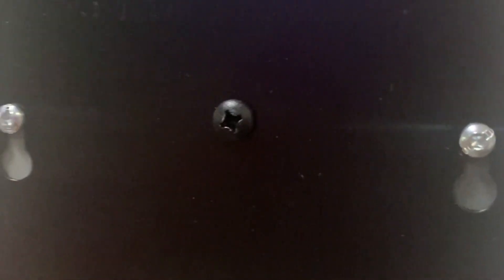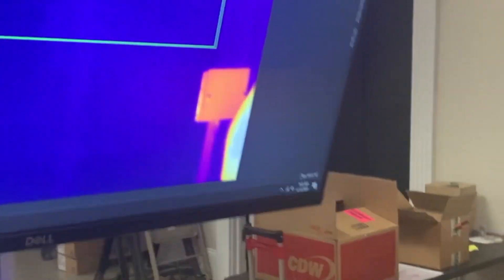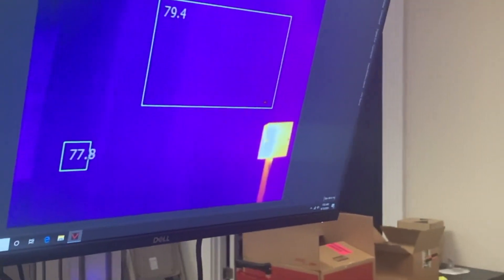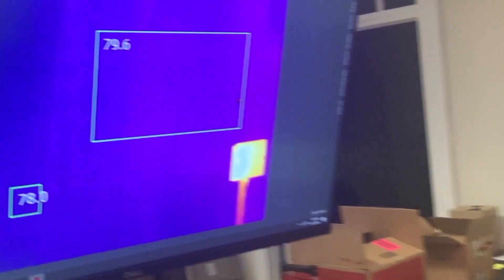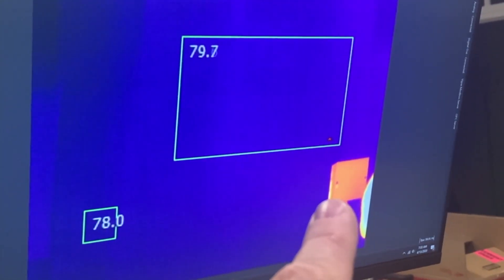For the reference emitter, this is the reference emitter cord that comes out from the bottom. It's just a quick connector, and then you have this plug that goes straight in here — a nice and easy connection. You shouldn't have to open this at all. All this is physically doing is warming up that box to give you a known reference, so that when you look in your field of view, you have a reference spot. You're going to place the smaller box on top so it's always in the field of view.